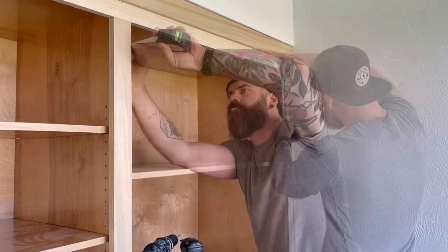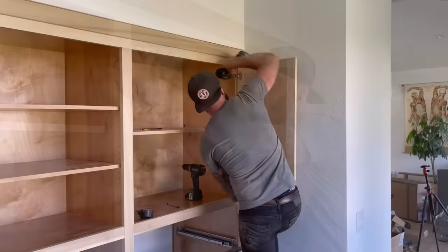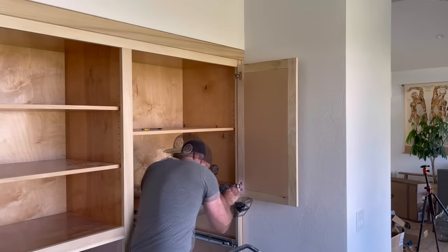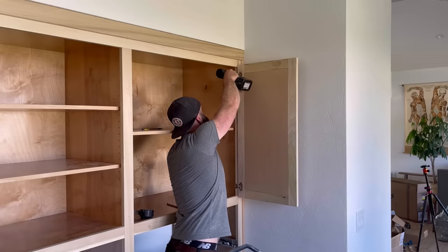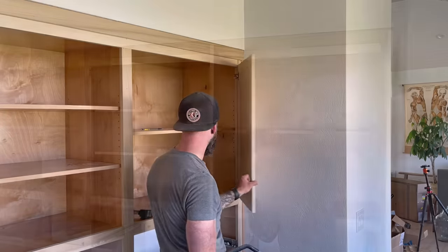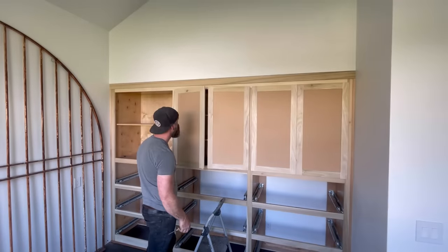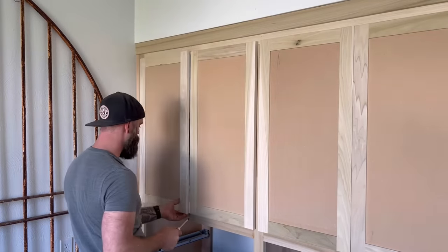The hinges I'm using are face frame full-overhang hinges. They're super easy to install because they attach directly to the face frame — I just pre-drill where I want them to land and screw them on. It's easy to determine placement because they're a half-inch overhang. I measured three inches from the top of my cabinet door, so I measure down two and a half inches from my face frame, pre-drill a hole, and slap my cabinet door up there. I'll include a link in the video description for these exact hinges. You can get them in soft-close or standard, whatever you want.